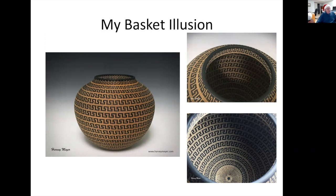And this came in at somewhere around 55,000 little tiny individual squares. The reason for that is I normally use a 1/8 inch beading tool, but I did this one with a 3/32 inch beading tool. Plus it's indexed to, I don't remember, but probably well over 200. So if you do all the multiplication, it all came out to over 55,000 little tiny beads in there.